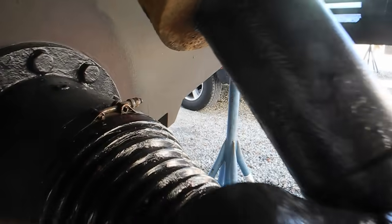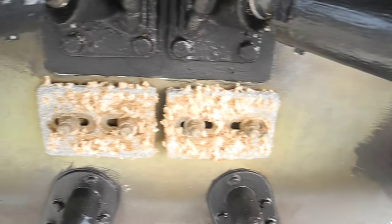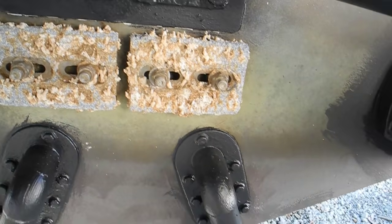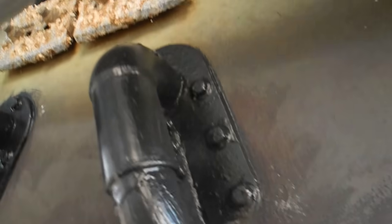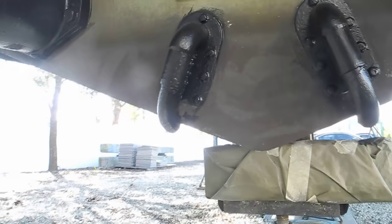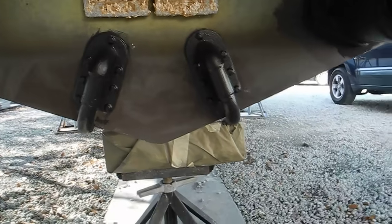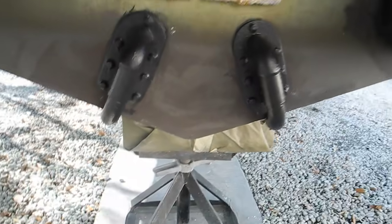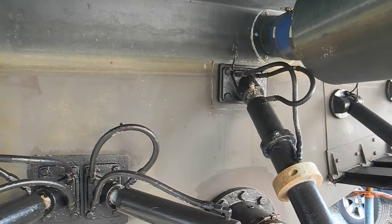This is the waterproof bellows for moving port and starboard, right and left. More zincs. And these guys are kind of strange — these look like scoops where they can actually pick up water as you're going forward. I've seen something like this; it's a very simple design. I've seen it on a Bravo 3 MerCruiser inboard-outboard. So as the boat's going fast and forward, it's scooping up more water and running it inside to some kind of a cooling mechanism.